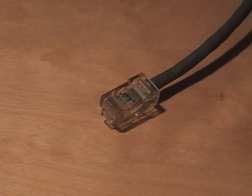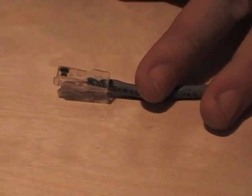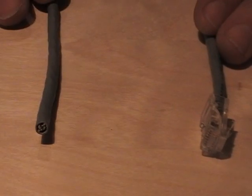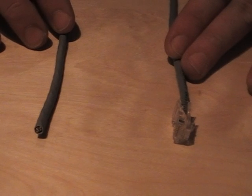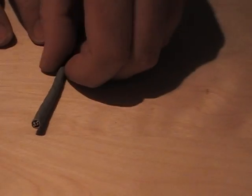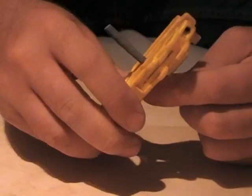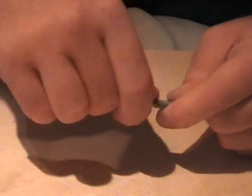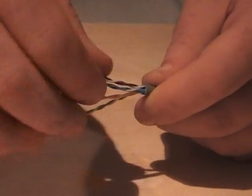Okay, we're going to put the other end on the cable. I've pre-cut this. The maximum cable length for CAT5 is 100 meters. The minimum is ½ meter. This is there or thereabouts ½ meter. I'm going to be scrapping this cable anyway, so it doesn't matter too much about that. Get my strippers, take off 1 inch, 1.5 inches of cable, and open up the pairs.